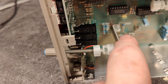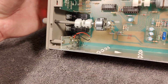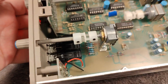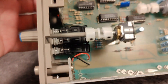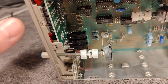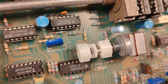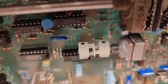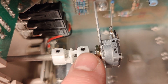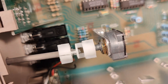It also isolates electrically. So that may be what they aim for here — we can see there is a metal ground, which is probably the pin. But you don't want when you touch this to get all sorts of hum into the system. So that is probably what they really want to have here. But they crack. See, they are completely cracked. They are made of nylon, and with those little set screws — when you turn those too hard you crack the nylon, exactly as we see here.